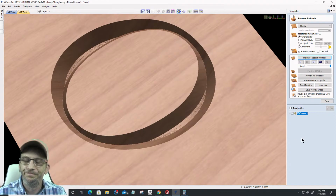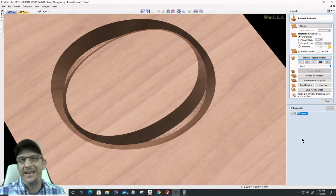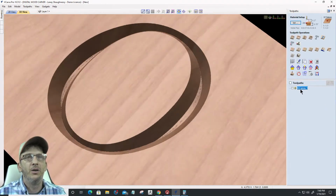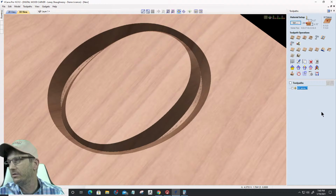So that was a whole lot of nothing. Basically, I would probably say multiple passes would be good, but if you are working with a smaller diameter 60-degree V-bit, 0.2 is a sufficient pass depth. I believe most machines can handle a 0.2 cut depth. Whether I am using my 60-degree 1/4 inch or my 60-degree half-inch, 0.2 is kind of my cutoff. I don't know if that answered the question.